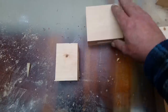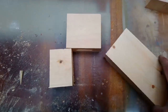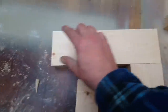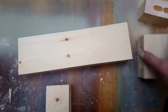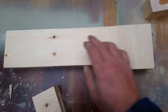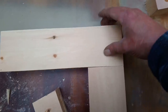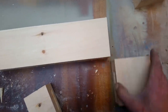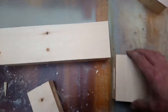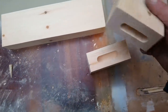But what I want to do on these doors is I want them pretty much flush at the top. I want the top rail to finish flush, and I don't want to finish the doors like that, you know, rail style here, top rail. So what I'm thinking of doing is that. It also gives a bit more weather protection, because when they're flying through like that, rain can sit on the top. So, just done a couple of tests.